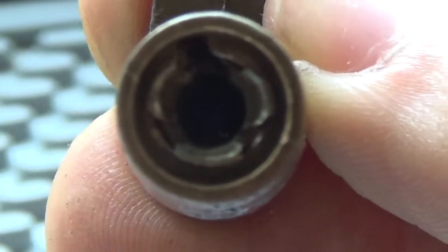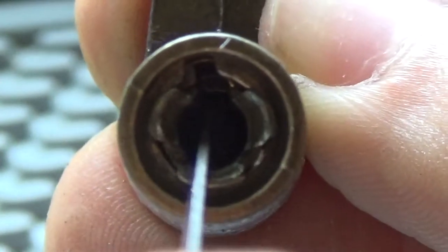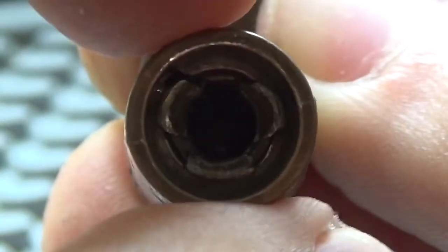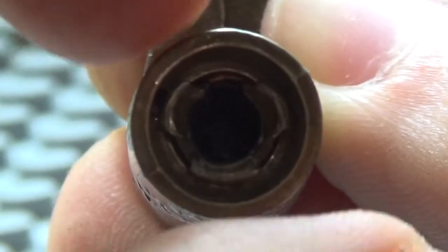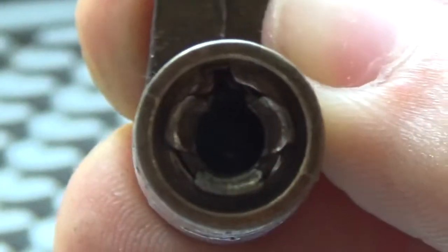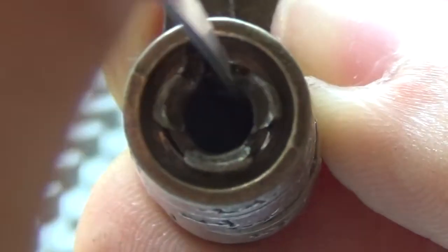If I turn a wheel you can see that gap there. Now when you turn a wheel to the wrong combination, you see that gap closes. That happens with each of these five wheels - when the wrong one is dialed in, that true gate gap which allows the locking bar to slide in and out is blocked by one of these inner wheels. There are no false gates on this, just the true gate.